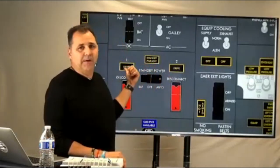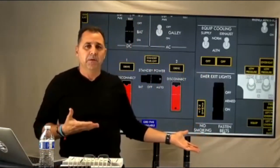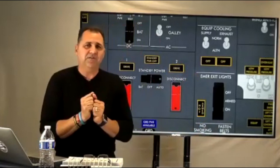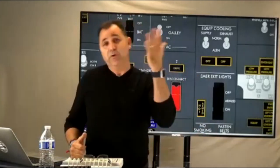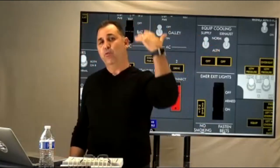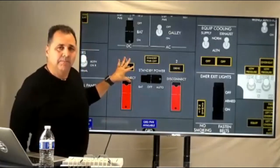The drive light came on first because of high oil temperature on the IDG. The critical question on the NG is: how do you know it didn't disconnect automatically? Boeing says the IDG can disconnect automatically or manually. If you select the generator on the AC selector and frequency and voltage are both zero, you know it already disconnected automatically. If you're still reading frequency, you have to do the memory items and disconnect it manually.